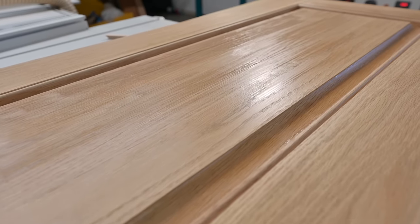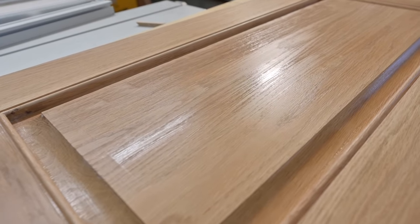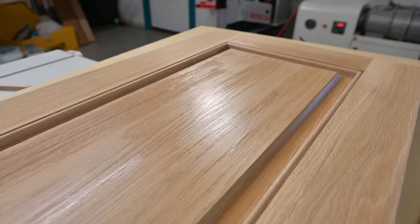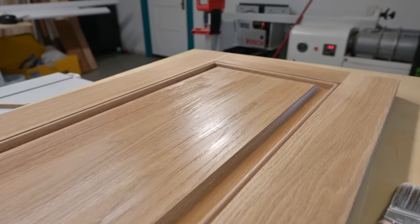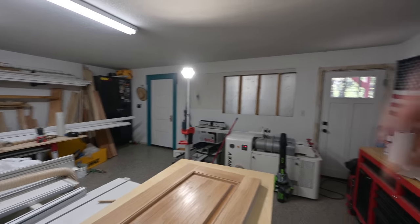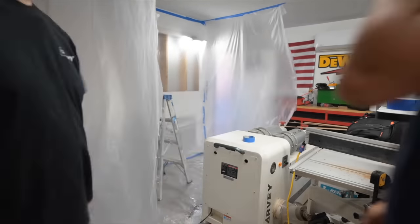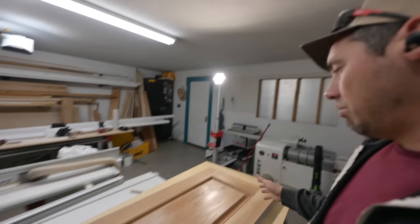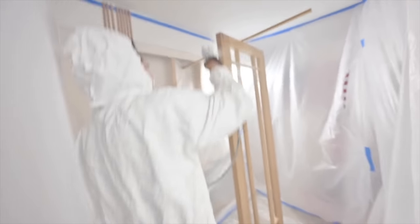Here's a look at the top panel I coated first — you can see it's in that mid stage where it has some dry and some wet but it's on its way. You can even see a horizontal brush stroke against the grain that will actually go away when everything dries. I'm doing this because it's so easy and almost identical to the finish I sprayed on my first white oak door, and it's just a lot easier and less stressful to brush this on, especially since I don't have a spray booth set up. Every time we spray in here I basically move the dust collection and build a plastic wall — it's a bit of a hassle. To just lay this down horizontally, brush it on, and wait 10–15 minutes is so much easier, which is why I decided to do this given the success I had on the floor.